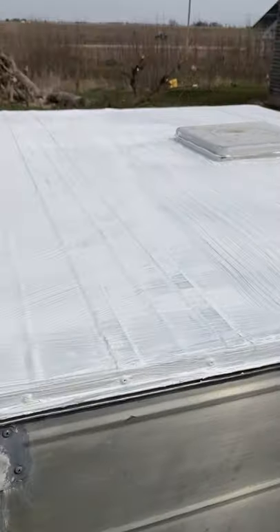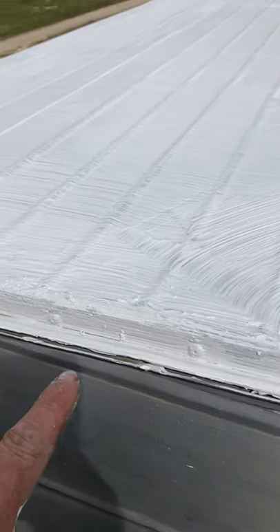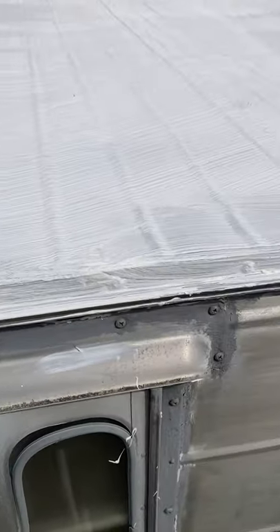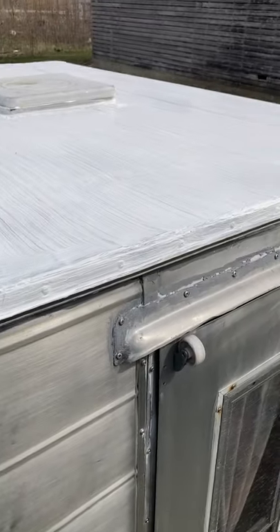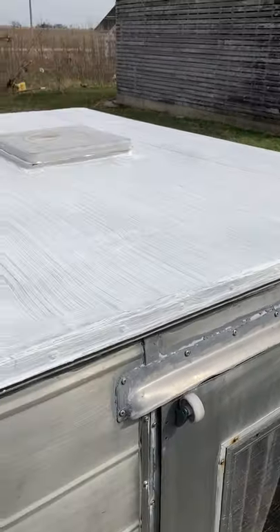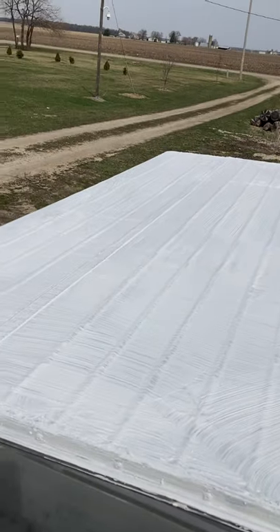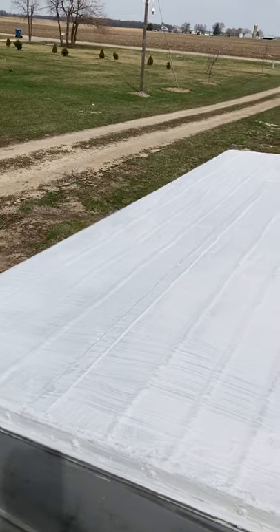Put a really good coat on. You'll notice I bring my roof edge all the way down and fill the drip edge and over these screws. I do that because I figure if it's one piece coming all the way over the edge, there's less of a chance it's going to run in behind and get down underneath of the windows.